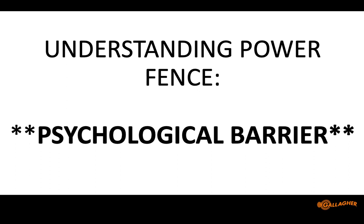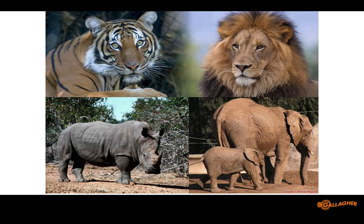In the US in the late 1970s, we found that high tensile smooth wire did not make a very good physical barrier — even 10 or 12 strands four inches apart, banjo-string tight — because if you got a little slack, animals could walk through it. So in the late 70s and early 80s, we started applying concepts from New Zealand, where the energizer was invented. We could take about a third as many strands of smooth high tensile wire, electrify them, and have a very effective psychological barrier — in some cases more effective than a physical barrier.